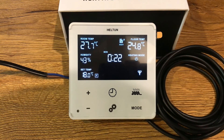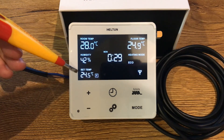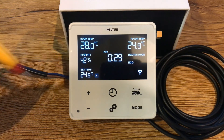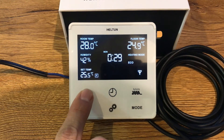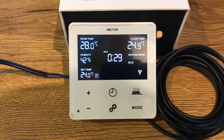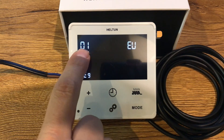Time mode allows you to set a different temperature for morning, day, evening, and night periods for each day of the week. The last step before going through the settings is talking about the set points — you can see the set point temperature on the display and increase or decrease it easily. To enter the thermostat settings, touch and hold the setting button for three seconds.